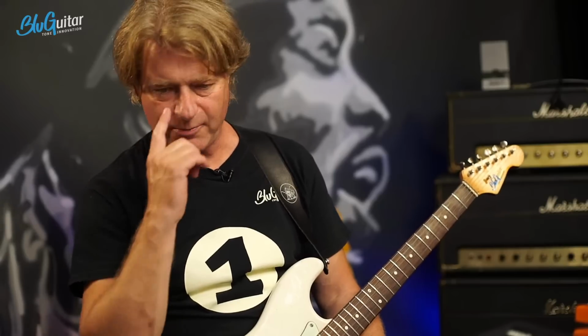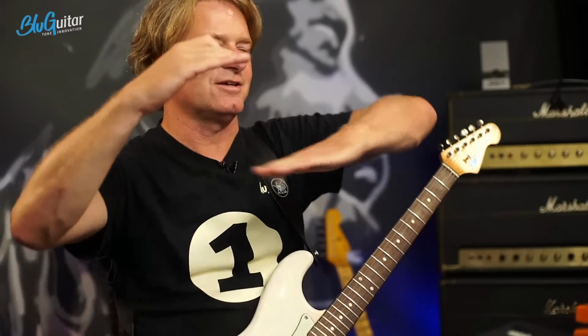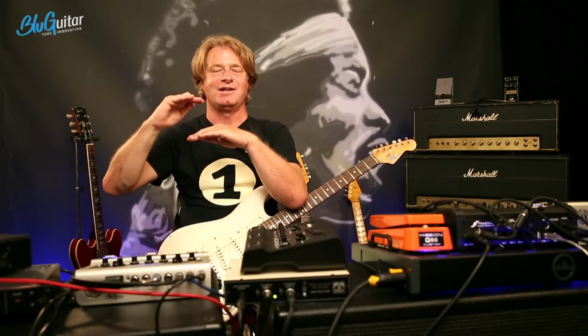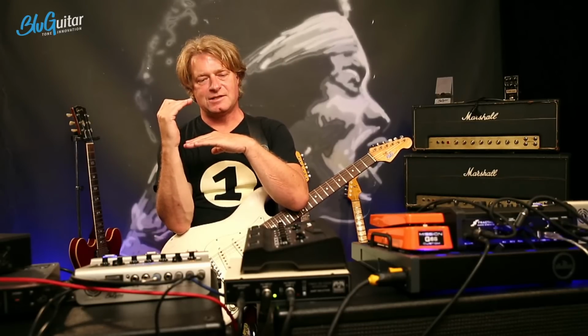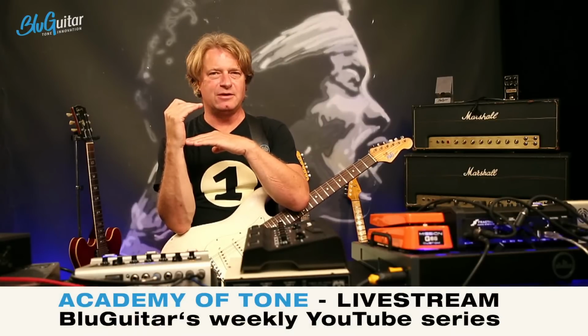But first, let me describe what's happening in the analog world. In the analog world, it's super easy. You have a clean signal, and then you have the headroom that is given by the power supply or the voltage that you have. And when you start to exceed that range, your component will simply clip. And there's different styles of clipping. There's some ugly clipping, and there's some soft clipping, and all kinds of components have a different style of clip.